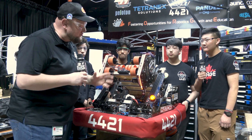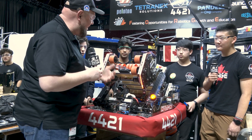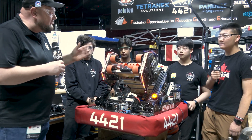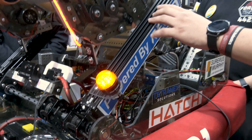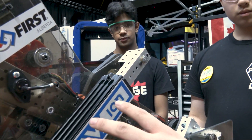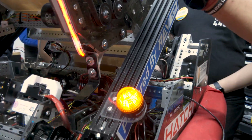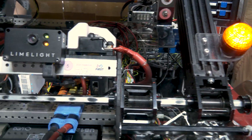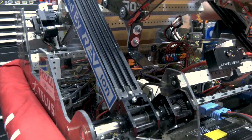Max, let's start off talking about this REV Linear Actuator. This is something I'd love to see function because I haven't seen it on a robot so far. So for the REV Linear Actuators, this is the first year they've been in FIRST, and essentially how we're using them is basically as a pneumatic — we're powering this to bring our entire shooter mechanism up as a rotation. That decreases a bunch of things: we don't have to use gears, we don't have to use pneumatics.